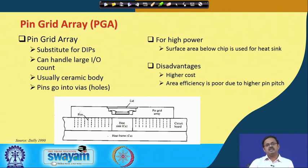With pins coming out, the pins on the motherboard go into corresponding holes. These holes where the pins go can be directly in the circuit board, or sometimes into something called a socket which in turn is bonded to the circuit board. Pin grid array gives a lot of flexibility — a large surface area for a higher number of interconnects. Typically these are removable — they are not permanent connections — and the surface area below can also be used as a heat sink.